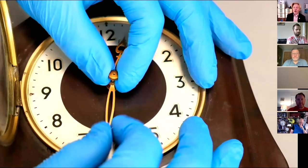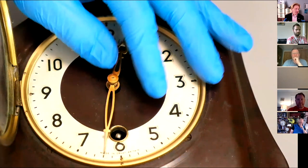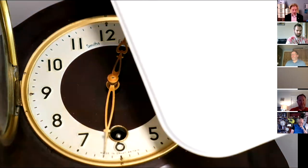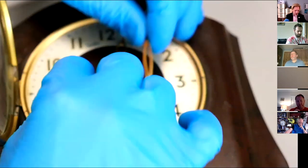Right, okay, the minute you think about taking a clock apart, particularly for the beginner, but for everybody, photograph it. Most people, lost my phone, but anyway, most people have got a mobile smartphone nowadays with a camera built in. Make sketches, do drawings, take dimensions, and make photographs before you take it apart, because it's ever so easy to say, I'll remember how it goes back together, and then when it comes to it, you can't. Then the second thing is, I've got some paper trays here, just to keep the parts in, to stop them rolling away and falling on the floor.